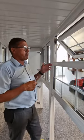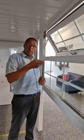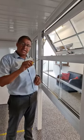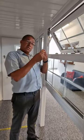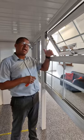Now if you live on the top of a hill and there's lots of wind, you may need to add a bit more friction. If you prefer it to swing to a certain position, you might want to release the friction. All you do is turn that in the opposite direction, unscrew that little grub screw and that will take the friction off.